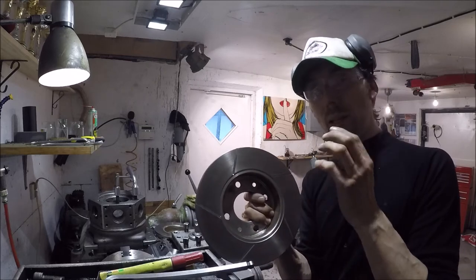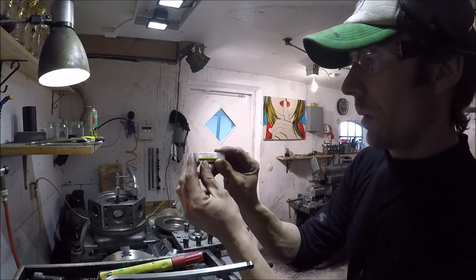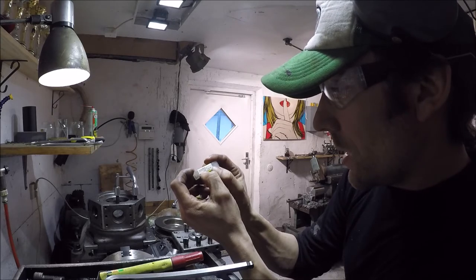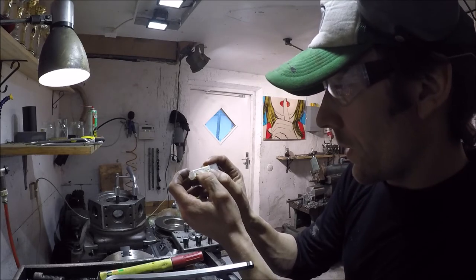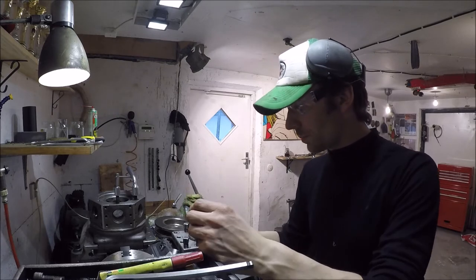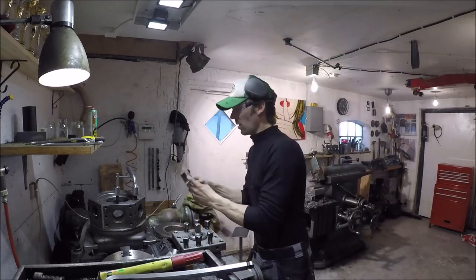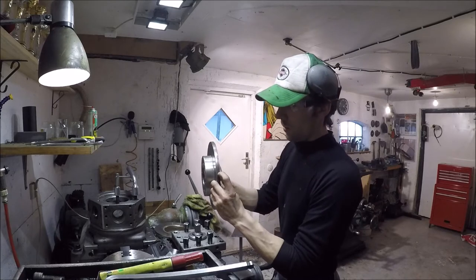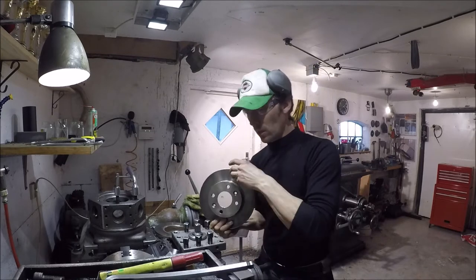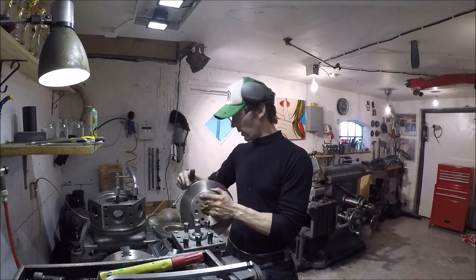I think this has a lot to do with using a very good quality mill. It's a Kennametal end mill — the name is UEBC end mill D4. There are a lot of other numbers, but basically it's a ball-nosed end mill, four millimeters wide. I've taken off two millimeters of material in one pass and it's working perfectly. I'll let you have a look at the setup.